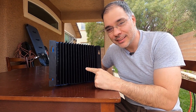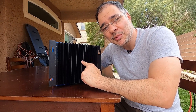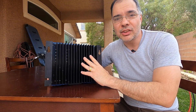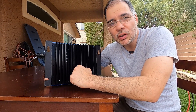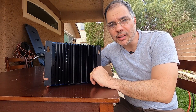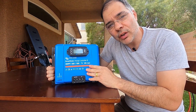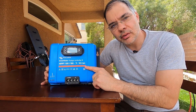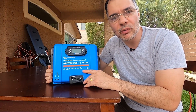Look at the size of the heat sink — no fans. That means high heat dissipation with a maximum efficiency of 98%. Having no fans also means longer life and less chance of failure due to fan malfunction. Manufacturers can often get away with using lower quality components when fans are employed 100% of the time. This just adds more overhead to the idle consumption rate and thus uses more power. This unit can also perform well where airflow is not optimal such as boats, RVs, or vans. The charger output will suffer if the temperature gets above 40 degrees Celsius. It is always best to install all equipment in a well-ventilated area.